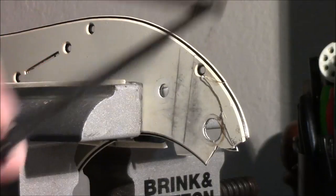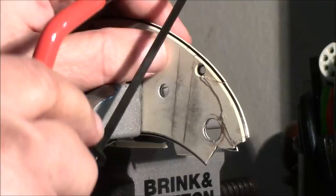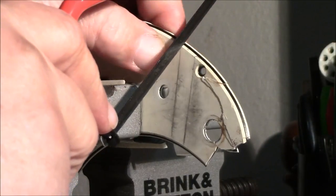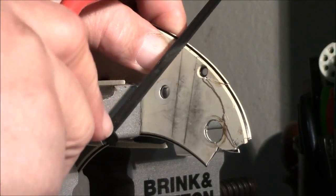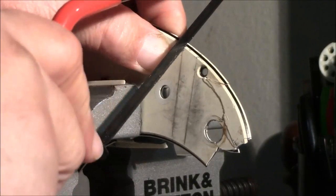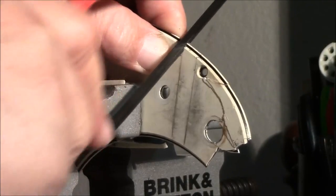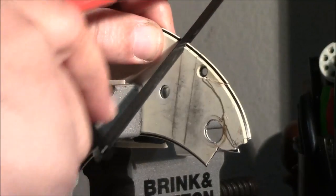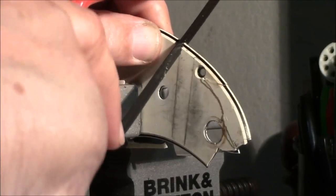Now we'll go all the way through, that may go close. Anyway, we'll have to check it out and see. And it's always important to get that first stroke started properly, and it's okay to miss it long. You just don't want to miss this thing short or go into this line I've drawn. And I'll just cut it straight down this line, right of that line, just like that. Make sure I stay right beside the line and don't cross it.